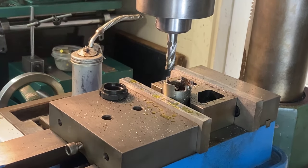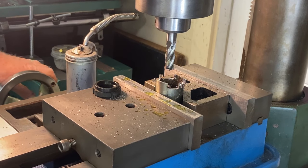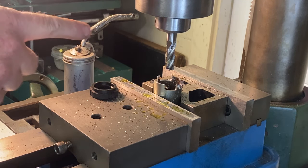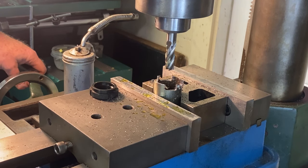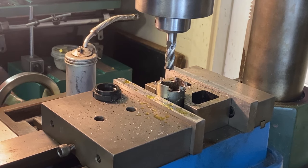Of what I'm about to do. We're gonna go back to zero now. Zero, zero. So now what we want to do is move the X over 345 thou, and then we'll cut on the Y. Why? Because we can. So now we're just gonna go 345 thou.